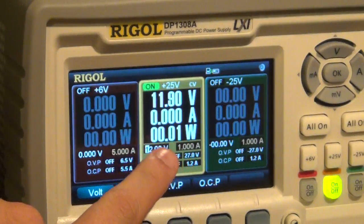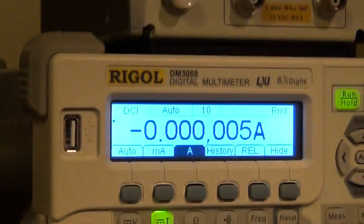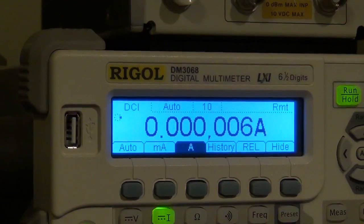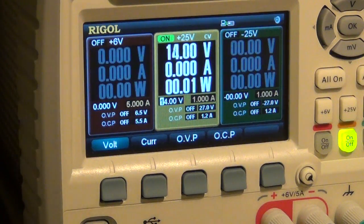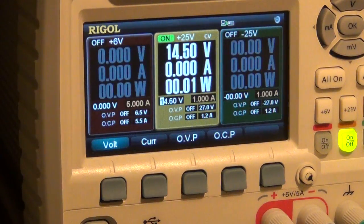So here, now the voltage is going to continue to go up, 12 volts, 12.2 volts, but now the current has basically dropped down to 0. So the diode is now an open circuit. It completely burned down. So I'm going to let it run all the way to 20 volts, and then I'm going to replace the diode with another one, and we're going to do this a couple of times, and I'll show you the plot being generated as the last step.